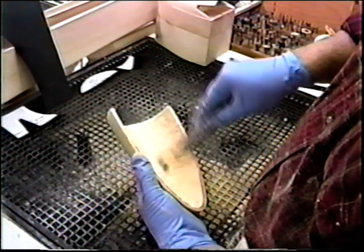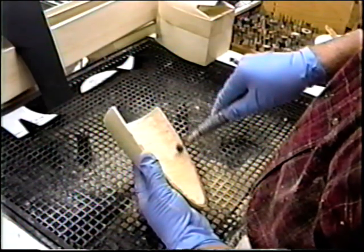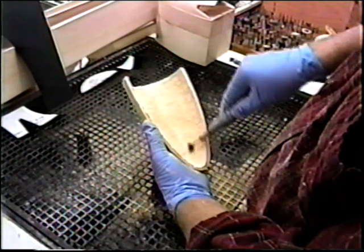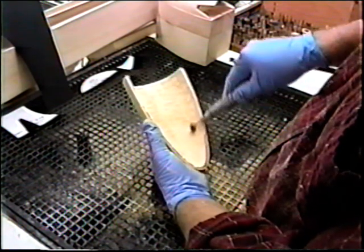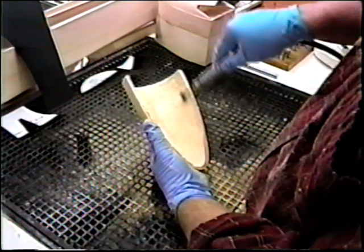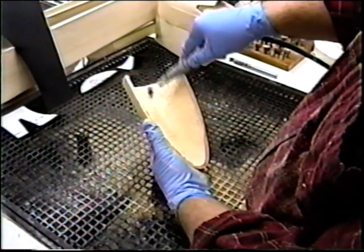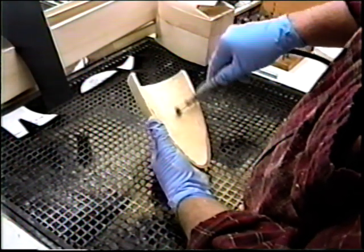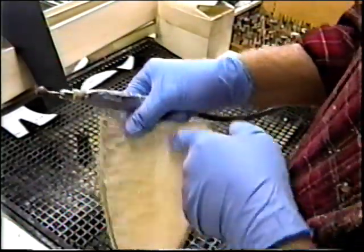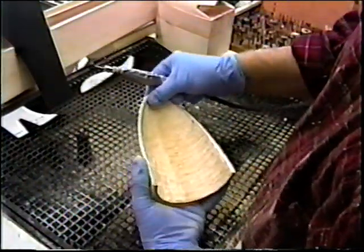And what I'm really doing now, this last 64th of an inch, is just taking little by little off. There's a high spot. So I want to do half of this so you can see up close. Now you can see we have the lines off in this dimension. Now I just have to switch and do the other side.